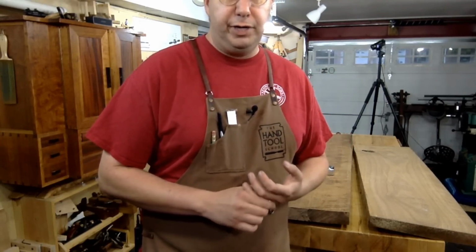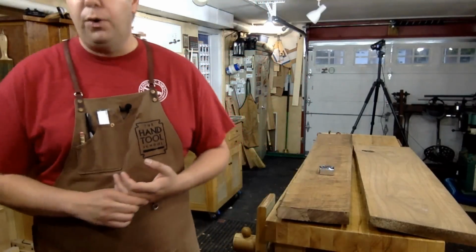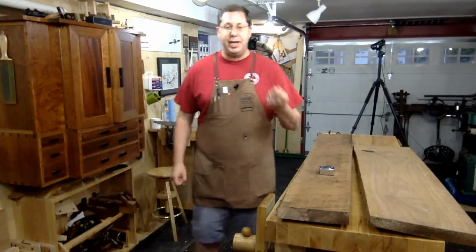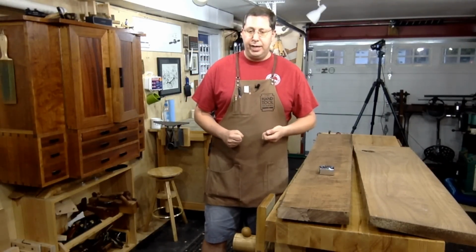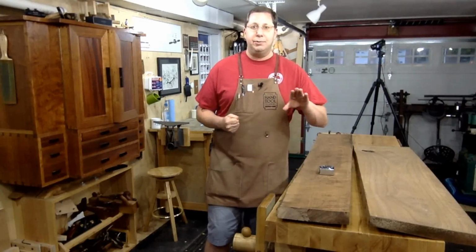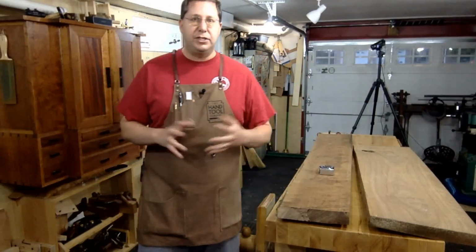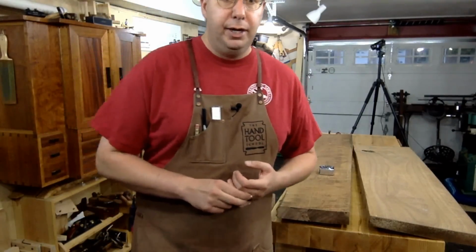Sean: lots of carvers use a variation to do all those different shapes. What do you mean? A variation of the, oh, I see what you're saying. Yeah, good point. So, you know, have a dowel, wrap sandpaper around it. You can get inside the flute of a gouge. You can use the gouge to carve the negative shape of the gouge, line it with sandpaper and sharpen your gouge that way. Line it with carving compound and sharpen it that way. It's an adaptation of the Scary Sharp method. So yeah, there's actually a really good example. Thank you, Sean. I appreciate that.